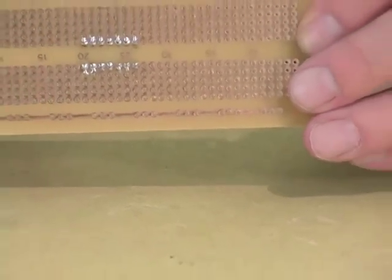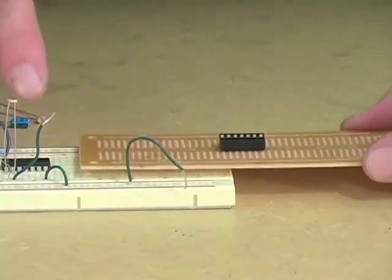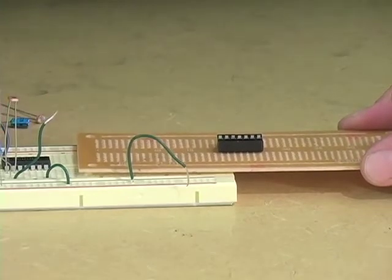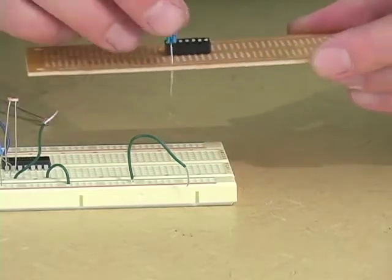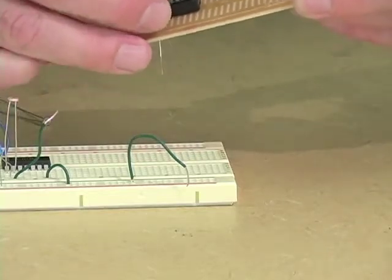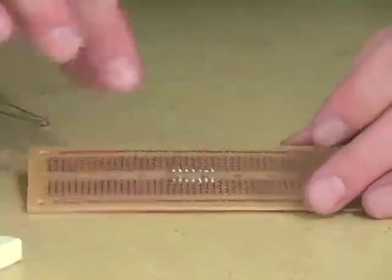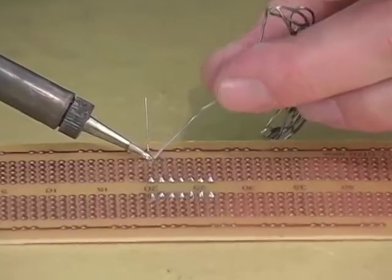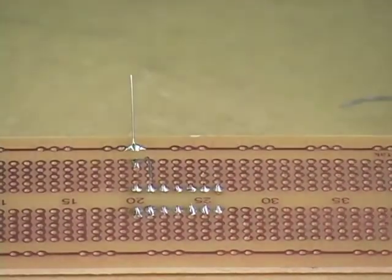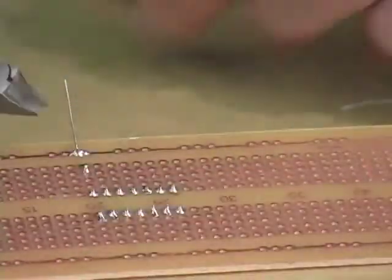When the job is done, it should look more or less like this. That was the most difficult part of the soldering. Now you bring your little circuit in side by side and copy each aspect of its design. Here is a capacitor going from pin one to ground, so we're going to put our new capacitor in from pin one to ground. We can press it down so that it's a lower profile, and the legs bend over just a bit to help hold it in place. Then we solder one leg and the other. Make sure your orientation is correct — the minus leg is going to ground — then take cutters and cut off the excess wire.